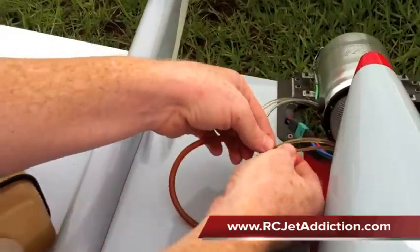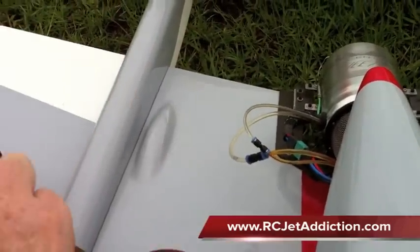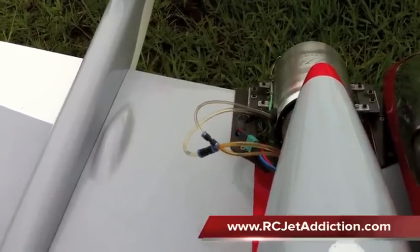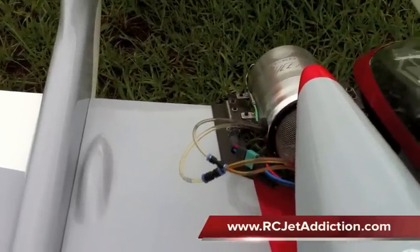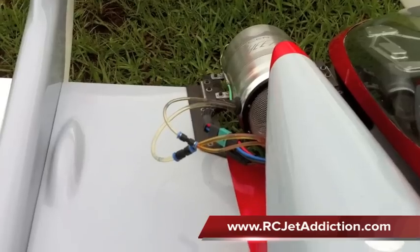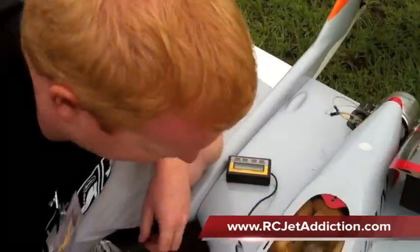Alright, so we stop that. Disconnect from our overflow, reconnect to the engine. And now we'll run it again, just like the main fuel — into the engine. Stop. And now I stopped it — no fuel is moving. On — one, two, three — off. Now the engine is perfectly primed. Should start the first time without any problems.